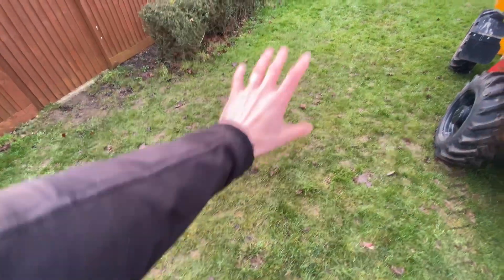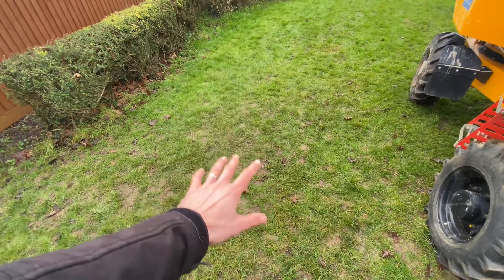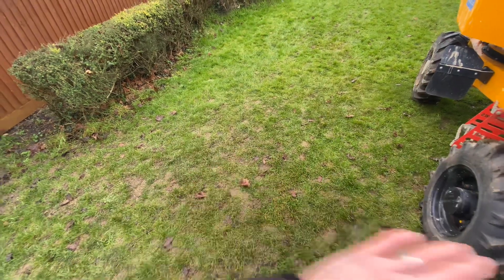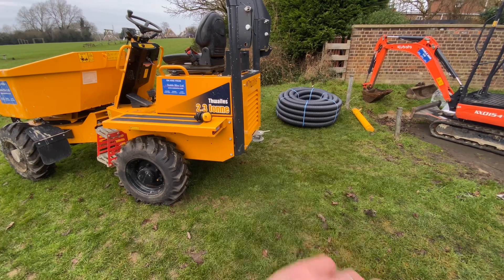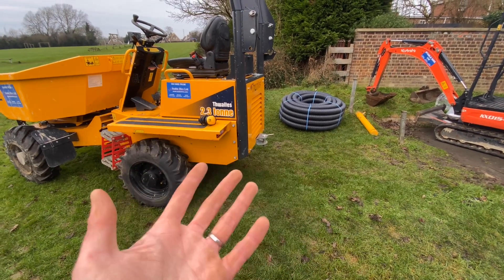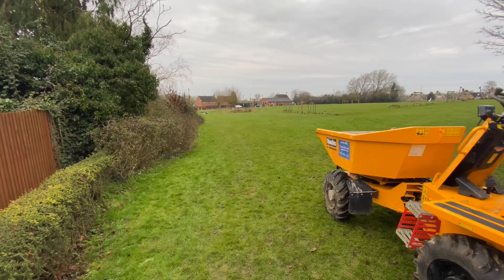As you can see, this is the area that gets quite waterlogged. When water is sitting here, it seeps into the ground, hits the gravel, flows into the pipe — the fabric around the pipe and the trench acts as a filter to get rid of mud and any nasties. Then with the correct fall it travels down into our soakaway.